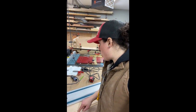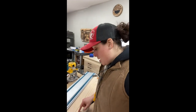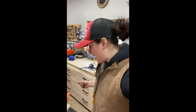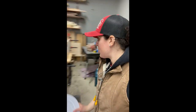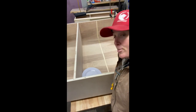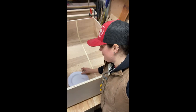I spaced these at one and a half and two and a quarter — actually it comes out to two and a quarter and three because I had to include how much sits inside the dado. These are a quarter inch wide from the box bit and a quarter inch deep. Here's my plastic dinner plate — you can see it fits in there nicely. It'll lean against the back. You can also go for a steeper angle — options!